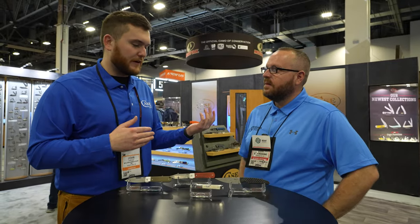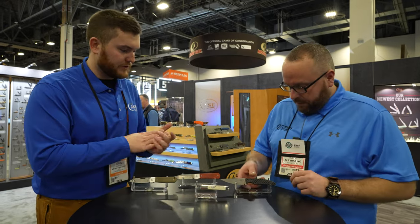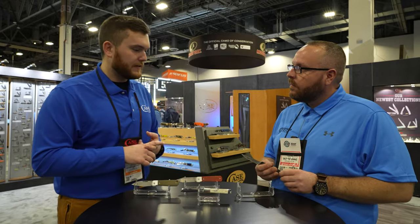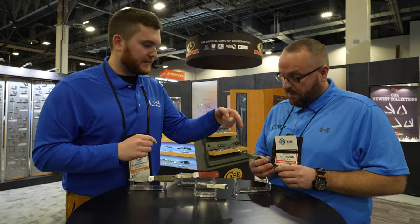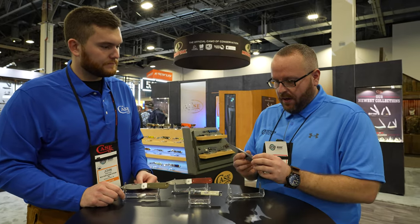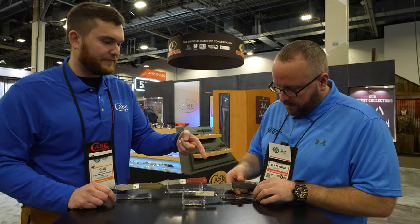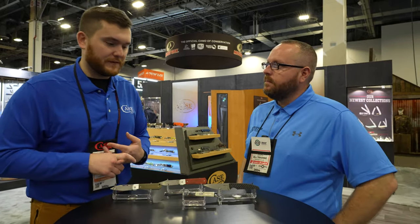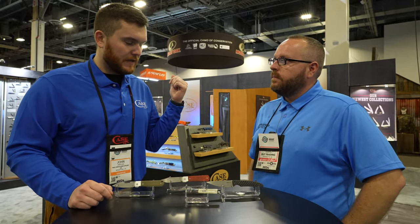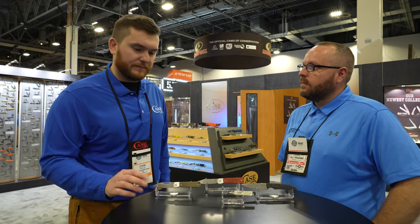We've been making fixed blades for years — the Leather Hunters, Buffalo Horn Hunters, Ridgeback — but now we've got a more modern style fixed blade. These are screwed together just like the modern EDC knives and made using the modern EDC equipment in our factory. Something really cool about the CT2 is a hidden lanyard hole. Lanyard pins can throw off the looks of a knife, so being able to add a lanyard through the pin in the back in a hidden style is a nice touch. That's going to have an S35VN blade on it. We've really only ever used stainless steel or 1095 on our fixed blades, so the CT3 has a black powder coated 1095 carbon steel blade. I'm super excited that we're getting S35VN on a fixed blade option — it's a great choice. Where we're at material-wise, I think we're right there alongside some of these other knife companies.